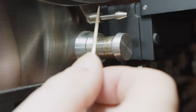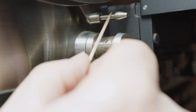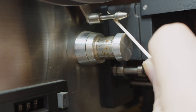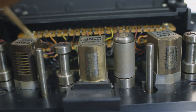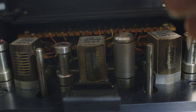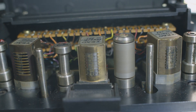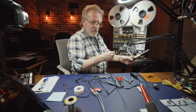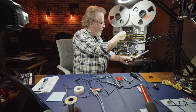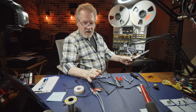This guide right up underneath here — where the tape comes behind it, goes around, and then down through the actual tape path — is going to have all kinds of crap on the backside because it actually holds tension on the tape when threaded. Record head, play head, and erase head. These are merely tape guides that are supposed to keep the tape in alignment. This is a roller with bearings in there, which is behaving fairly well but it's filthy. These are the lifters, which are typically only in contact with the tape when it's in shuttle mode — fast forward or rewind — otherwise pulled out of the way by the solenoid for the pinch roller.